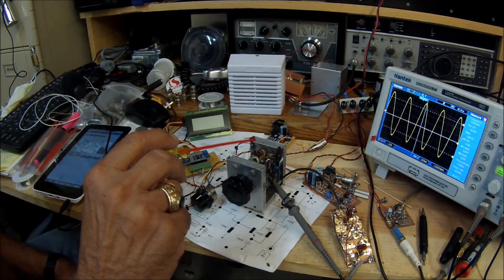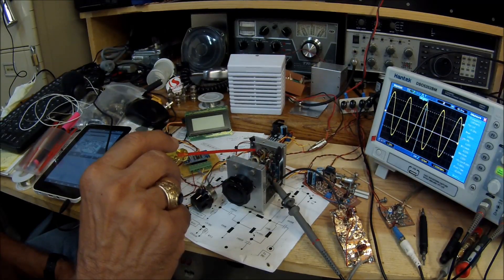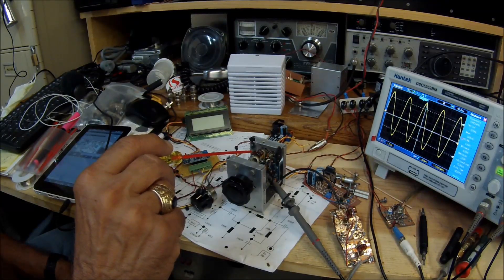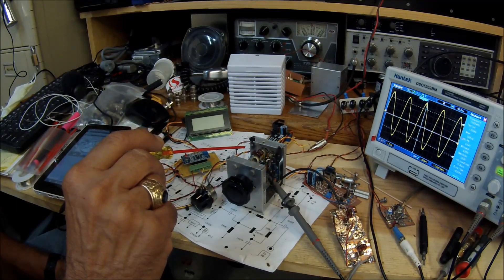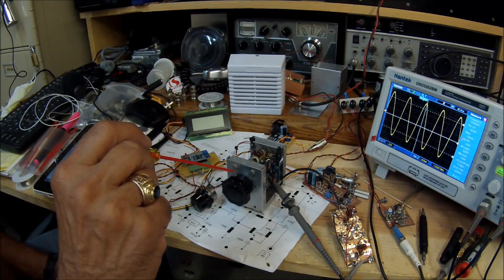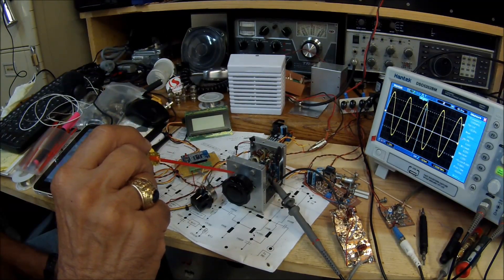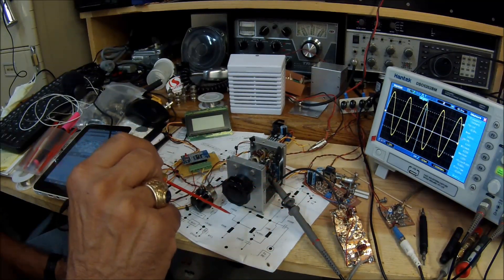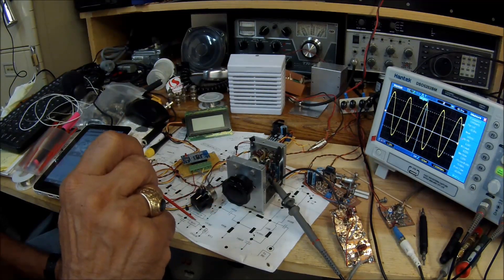What we are using for a local oscillator is a VFO that came out of a single sideband transceiver — homebrew — normally operated around 5 MHz. We moved the frequency up to 7 MHz since this is a direct conversion receiver. Direct conversion essentially means there is no IF. You supply a local oscillator signal which is detected in the double balanced mixer, and that detection is at the operating frequency — the only difference being the audio tone.